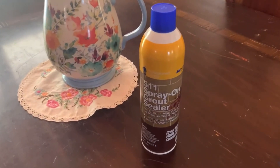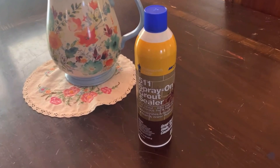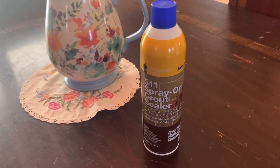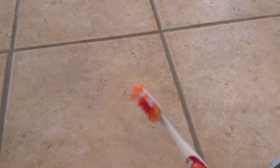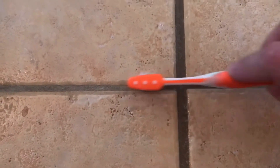The last thing I'm going to do now that all my grout has been cleaned is seal the grout to try to prevent any further discoloring or dirt or grime getting on there. We've used a different product before, but the guy at the store recommended this one — it's just a spray-on grout sealer. You press right here to spray, and I'm going to use a little toothbrush to make sure it stays in the grout lines. You can see there's a little extra that I'm brushing along here. I like that the grout turns nice and dark like this so I know I've gotten the sealer on really well.